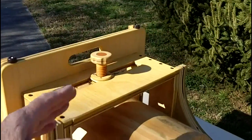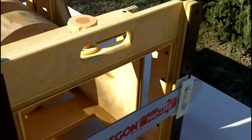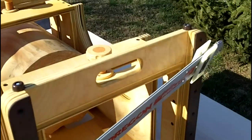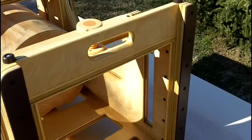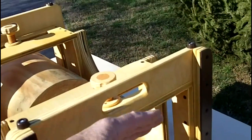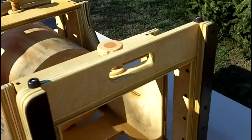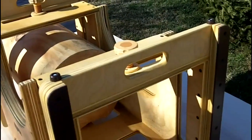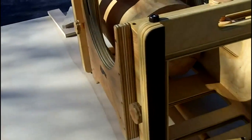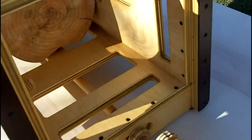But in the case of where you're going to go back and fan a cut, let's go back to the end here for just a minute. Once I've cut this end piece off, there's only log on one side of this bar. So if I tilt and start dragging backwards, only one bank of cutters is going to be doing anything, and it's going to give a real nice finish to this end. If a standard chain is on here, because of the angle, it'll want to slap sideways and cut into that face, whereas if it's straight across like that tooth I just showed you, there's not a tendency for it to go sideways or lateral off the bar. It'll go straight through there like a bunch of chisels and give you a really nice finish. In fact, the finish with a nice sharp chain in a beaver tooth pattern will be as smooth, if not smoother, than a bandsaw.